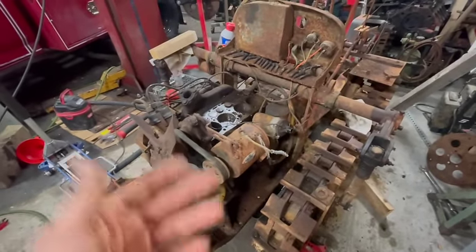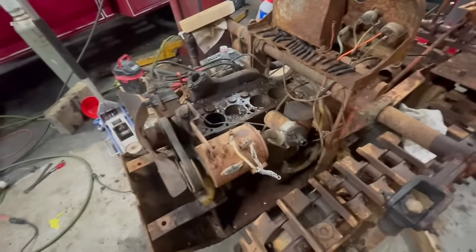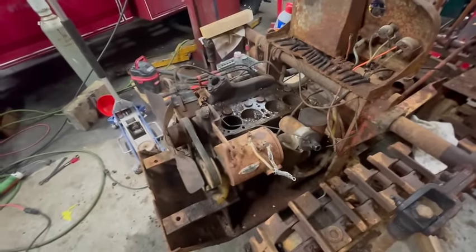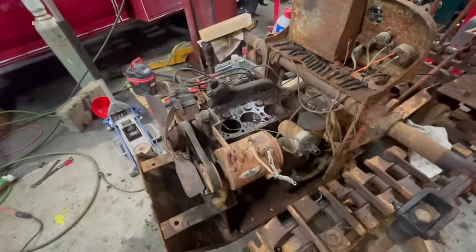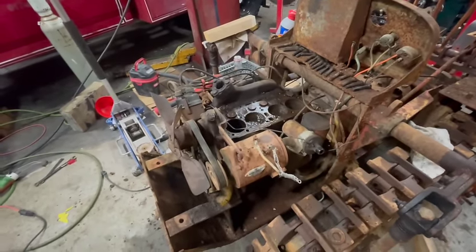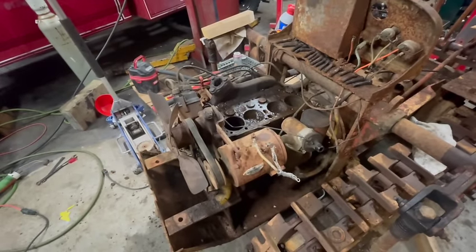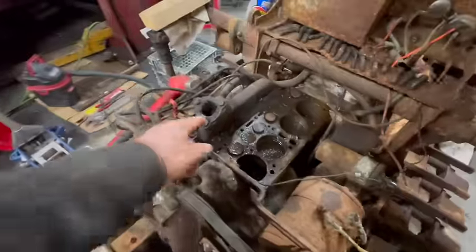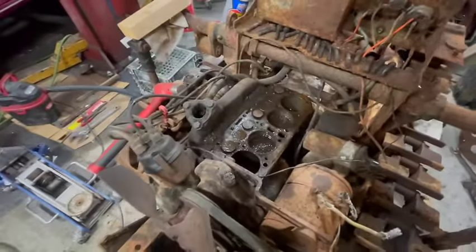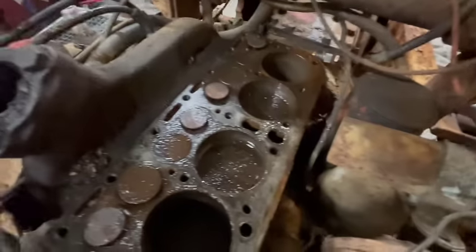I mean, I could be sitting here with five bolts broken off in the block and heads stuck on there, and we're not. It's got four stuck exhaust valves. That's not bad. Could be a seized engine, but it's not. And it's amazing for the fact that the exhaust was rotted off of it. And it's not seized, and the cylinders are nice.